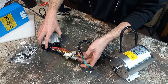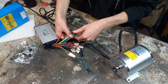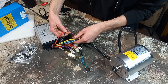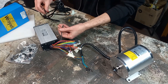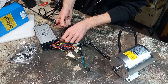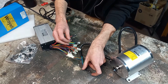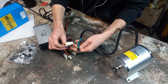So that seems okay. And then we have these 5 wires here. The yellow, green, and blue go to these guys. And these go to our battery. Our battery pack did come with this connector and one of these adapters. So what we'll probably do is cut the ends off here, solder that in there, and we might end up just replacing these with bullet connectors.